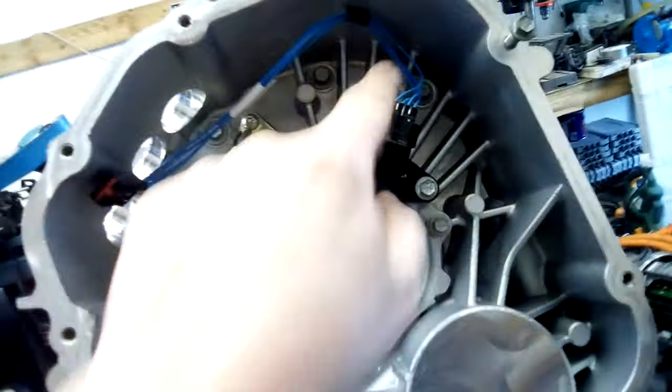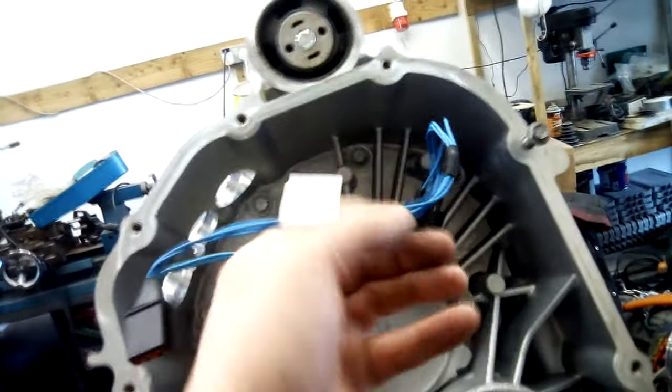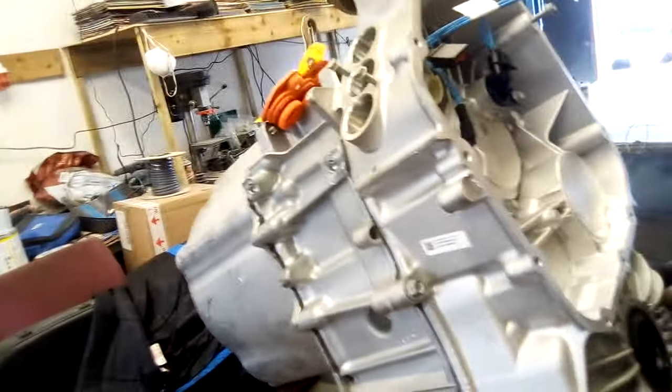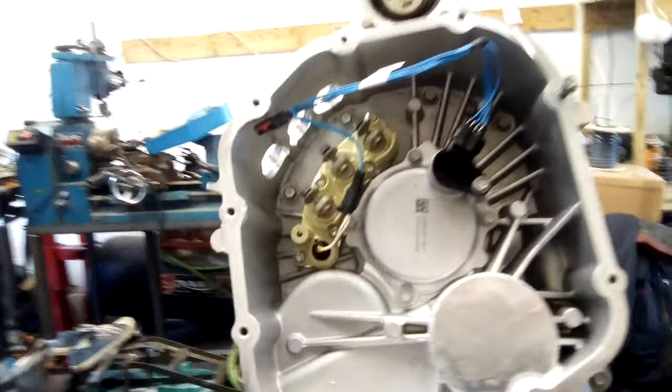This one's definitely a speed sensor. Now that's right next to the inverter - the inverter is here - so even though these wires are actually quite long, they could have made them much shorter, but they've obviously lengthened them to make sure you can bring the assembly away and disconnect them. They haven't even used screened leads because it's so close and the metal does the screening anyway. We could actually mount our own inverter onto there quite easily - straight into the three-phase - you've got your speed sensor and your temp sensor, which is pretty much all you need.